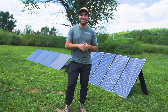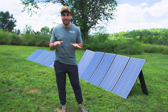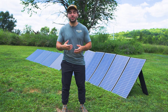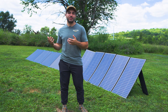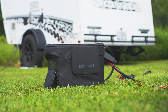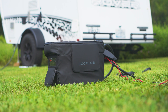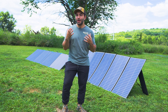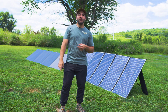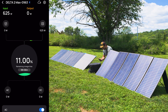Now with both panels side by side for a real-world test. The tilts are slightly different but I'm leaving them as manufacturers intend. I'm using the EcoFlow Delta 2 Max, which has a built-in MPPT charge controller, running about five tests on each to compare averages. Right now I'm waiting for a cloud to move. That's 700 watts between the both of them — the perfect time to test.